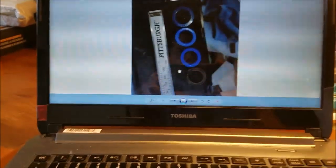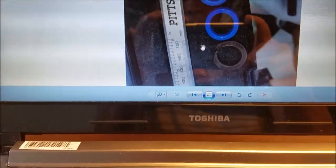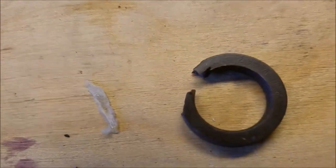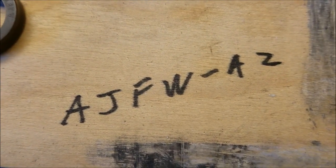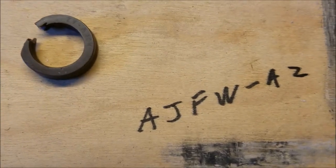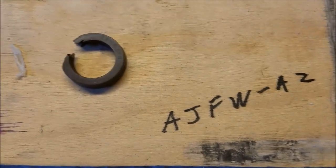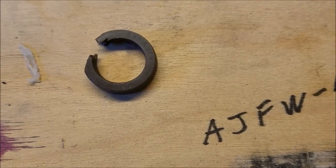This next segment talks about the seals. The original seal that comes out of the steering ram is this round seal — it's an oil seal, and there are numbers on it. If you can find one that matches those numbers, that's perfect. Otherwise, go to an o-ring shop or a hydraulics parts shop and see if they can find you one to match. The best way is to just bring the old seal to the hydraulic shop.